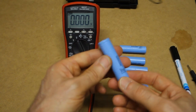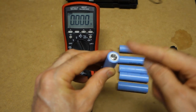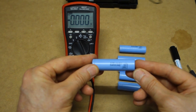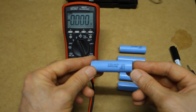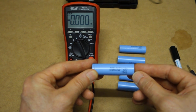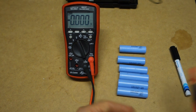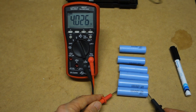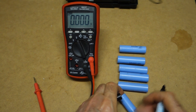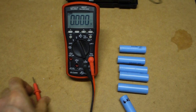That wasn't too bad. I've cleaned up the six cells - it took around five to ten minutes for all six. I've also removed the little metallic spurs using a Dremel very gently. Ready for the first test. Looking at what type of cell this is - it's a Samsung cell, originally a top-quality cell. The '28' at the end of the part number denotes 2800 milliamp hours or 2.8 amp hours original capacity. The first test I want to do is a simple voltage test with the meter - we've got 4.026.